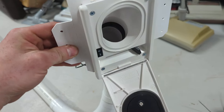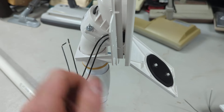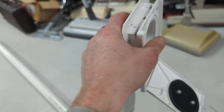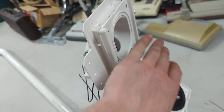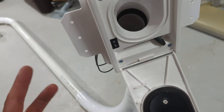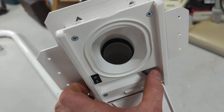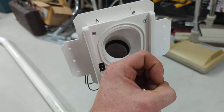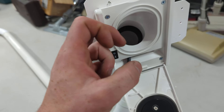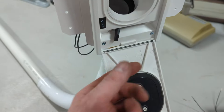On the trim, you take and put the valve body in. This is the door, but it's also the guts — the lock, the switch, the gasket, everything. For a retrofit, you would take these flanges off the sides and just shoehorn this frame into the wall, then assemble it, make your wire connections, and feed your pipe in from below or above. The thing that makes the Hide-A-Hose a Hide-A-Hose is how it locks the hose — this rubber squeezy bit here squishes around the hose, and whether it's a socked hose or not, it keeps the hose in position and provides something of a seal. It's not a perfect seal because there is a spiral leakage path around the spirals of the hose, but it is pretty good.